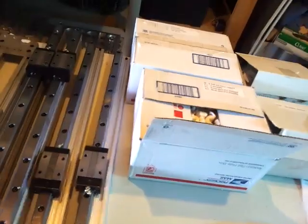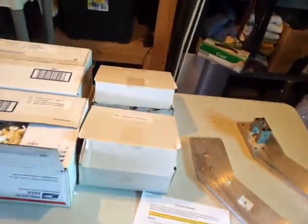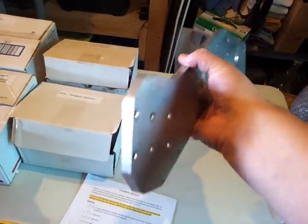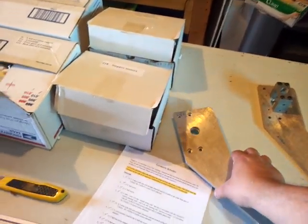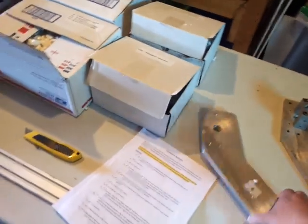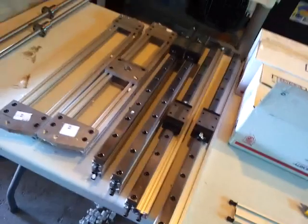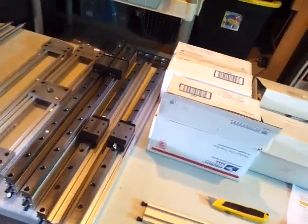This will allow me to do a lot more aluminum work, faster and stronger, because of the kind of material it's being used. The gantry is a half an inch solid sheet of aluminum, not forged or casted or anything — it's a CNC one sheet, 6061, half inch thick. The same thing for the rest of it; it's using T-slot and all good parts. All the supports on the ends are half inch also.